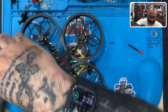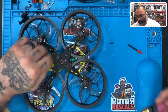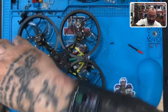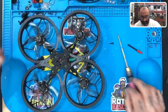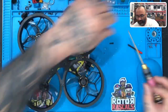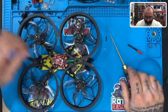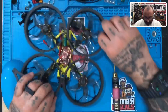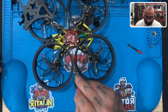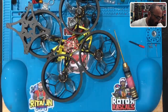There's a little trick with batteries - you can use a battery sled. We printed them and they work really well. You heat-shrink them inside the battery so they're the only thing touching the ground. Battery sleds have saved a lot for me. On the other hand you can put rubber standoffs on the battery. I'm going to tape some foam rubber on mine - when you do that it stands it up and you can put the strap in between, so at least that's something to scrape off instead of the battery.